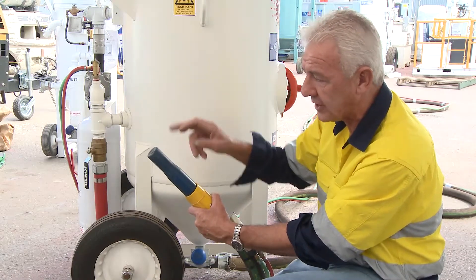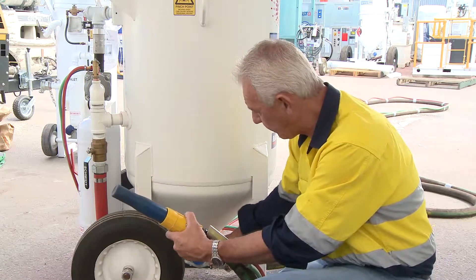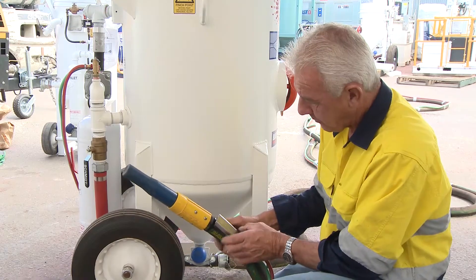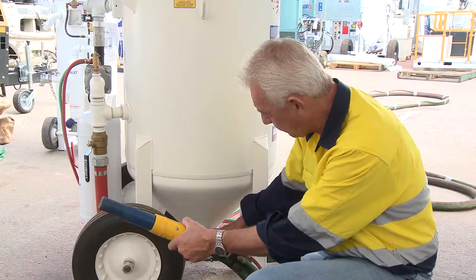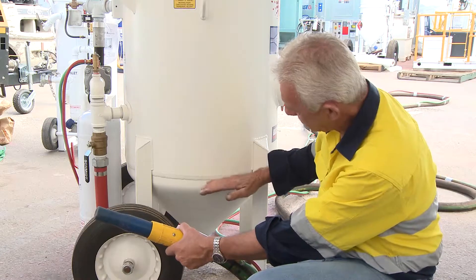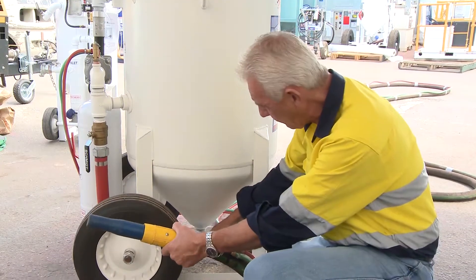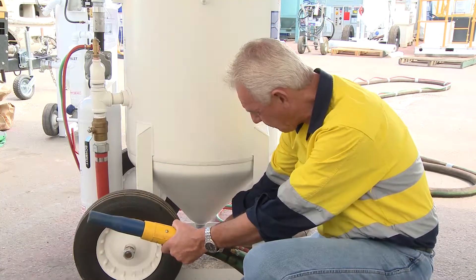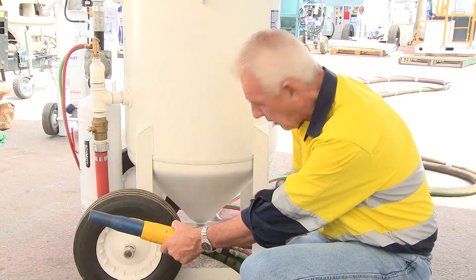Also, you'll find that it tends to flood the surface. One thing to remember: if you open that valve too far and you stop the operation by releasing the dead man, remember there's only pressure in the top of the pot. The grit in the conical section falls of its own volition. So if you open that valve too far, you'll have a flooding of abrasive in the bottom of the valve that tends to block the pusher line itself.